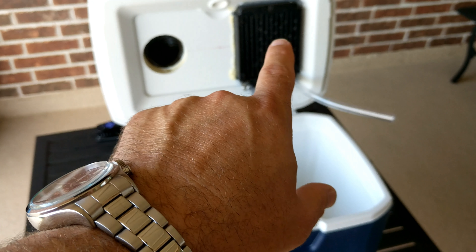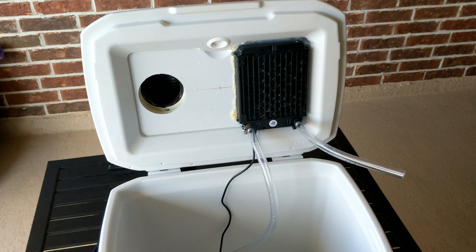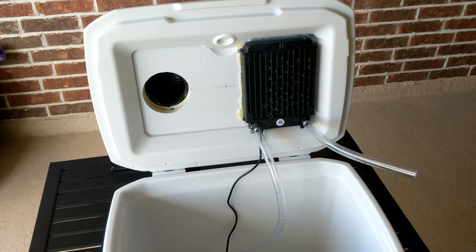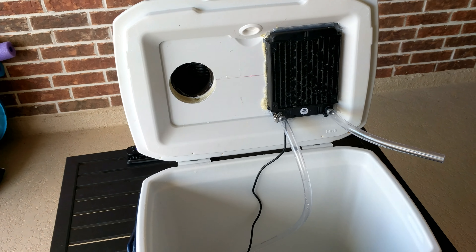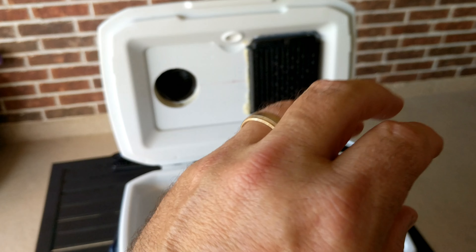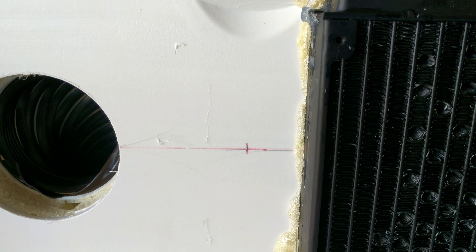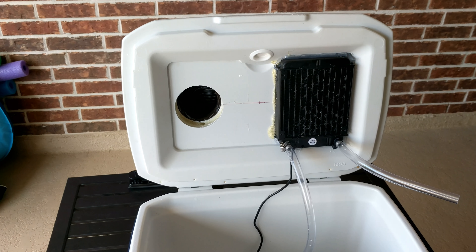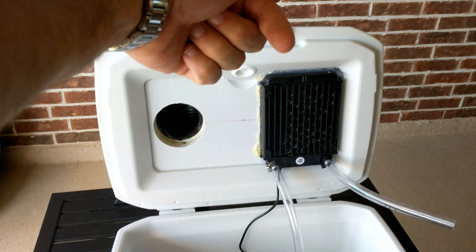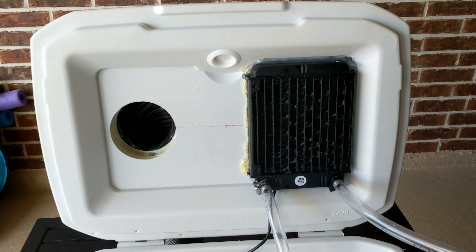On the inside, we have the radiator, which is on the underside of the fans. I originally had the radiator over here, but what I was finding is that water kept accumulating on this radiator. It's really designed for PC cooling — removing heat from a very hot surface — and not really chilling air down to 35 degrees. Along with the positive pressure and the surface tension of the water and the small gaps in the fins, it just wasn't expelling. The water wasn't dripping away.